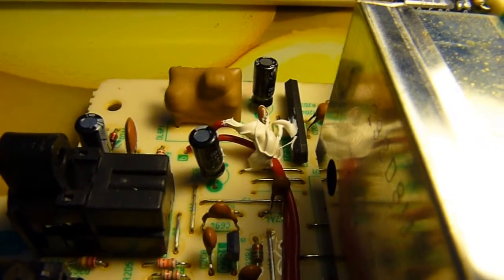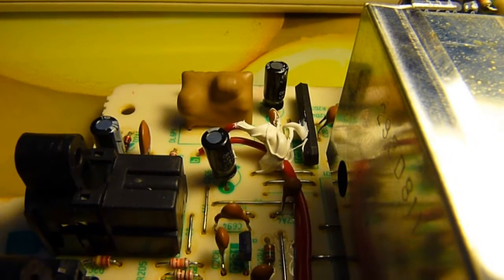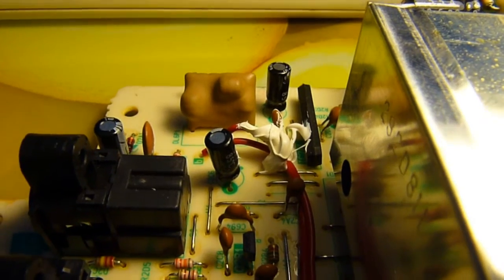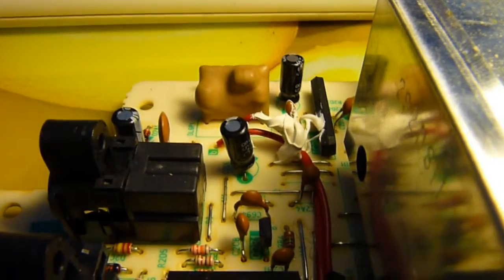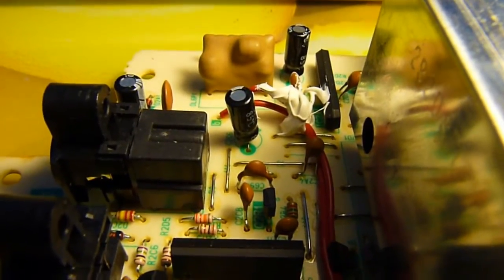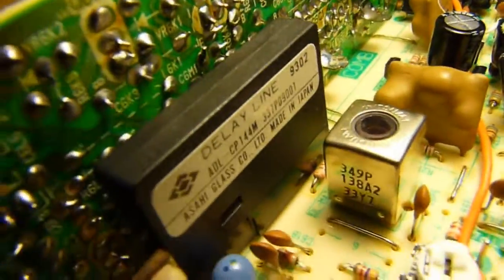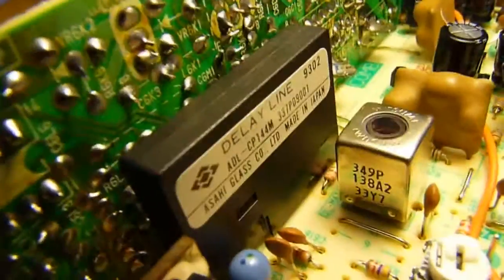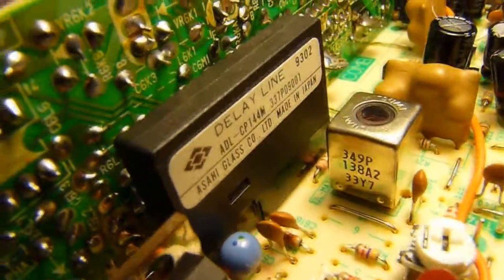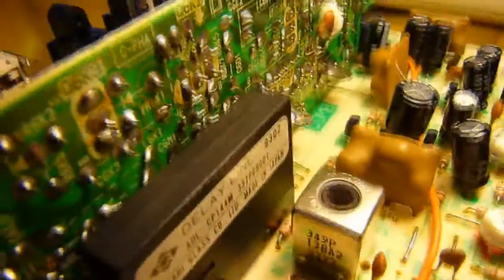And this is an LA7222, and this thing is a 2-channel, 2-position AV switch, usually for VCR audio use. You can see why I instantly recognise this sort of circuitry, can't you? Combine that with things like the delay line memory, which I will link to Mike's Electric Stuff video of that, because that video is absolutely bloody awesome, and he actually ends up putting bloody ASCII text through it in RS232.